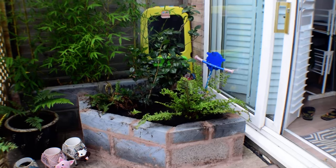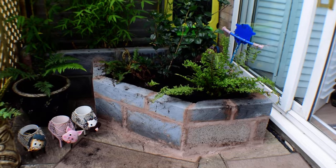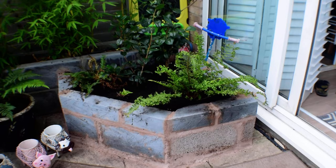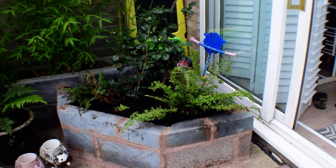You can see I finished the camellia bed here, or camellia corner as I'm calling it. I just buy the ready-mix cement in the bag and add water to it in a bucket. The blue blocks are Thermolite, so you can cut them with a wood saw — I can get these 45-degree angles on them without needing a block cutter.